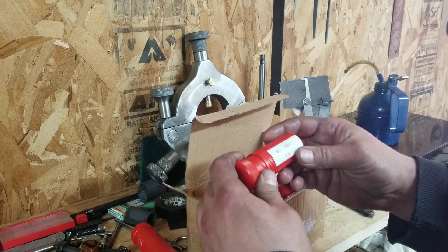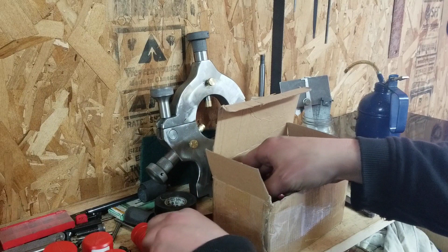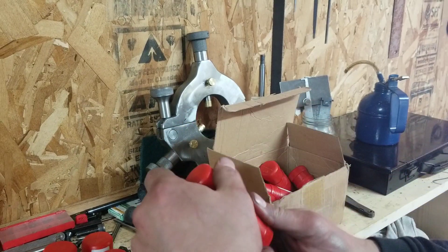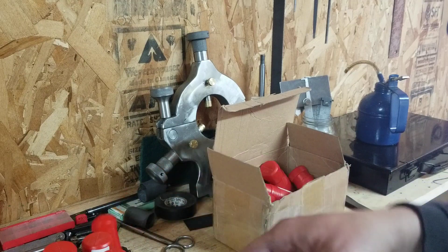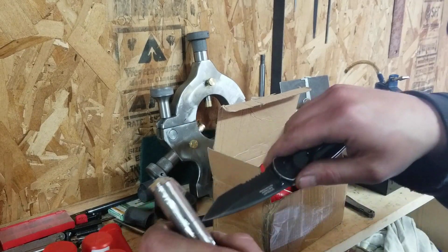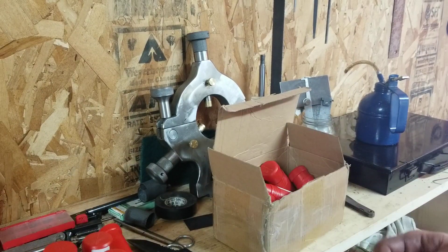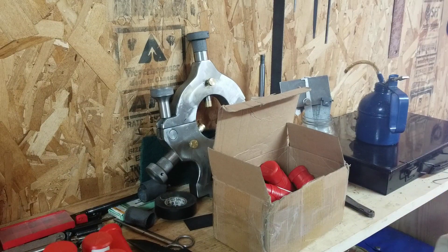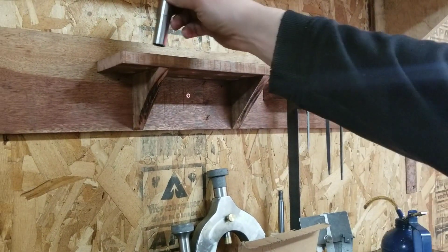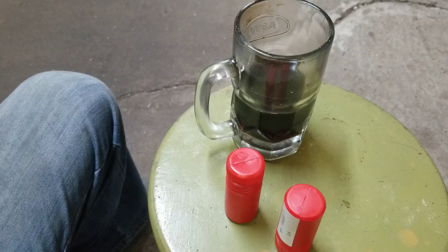Little by little the shop's turning into something. I picked up a 12-piece set of MT3 collets, and hopefully that'll spare me some grief over making end mill holders all the time - hopefully. Because yeah, trying to make a taper when your lathe is out of tram doesn't work so good. Little by little we're making this shop into something.